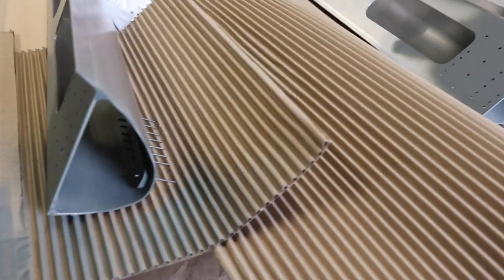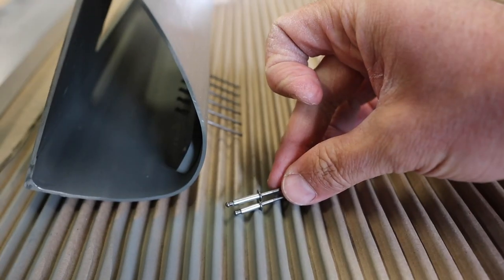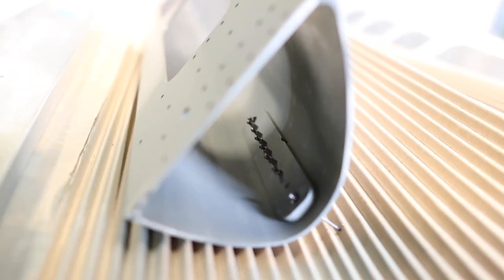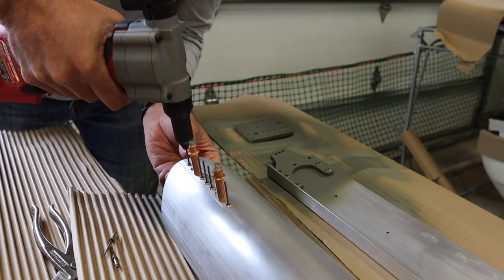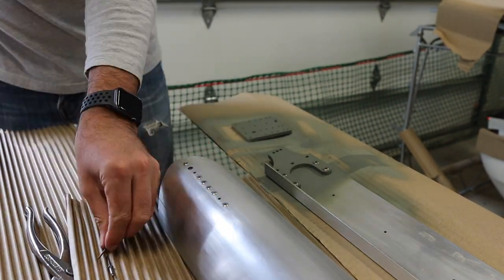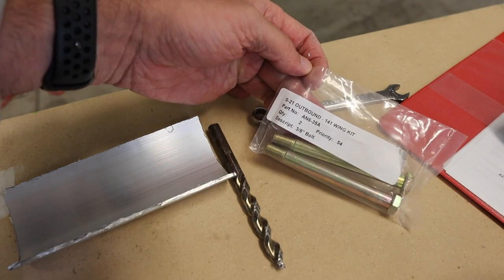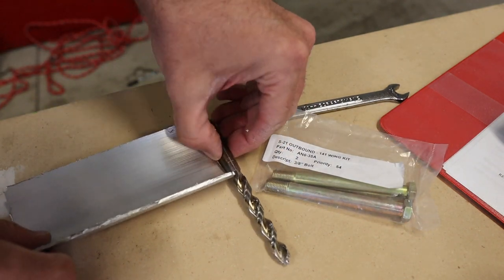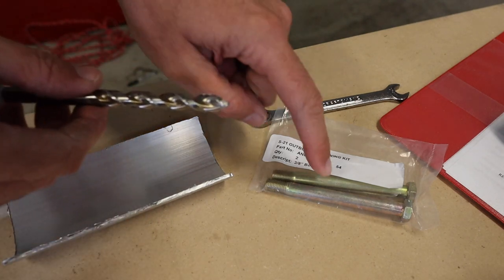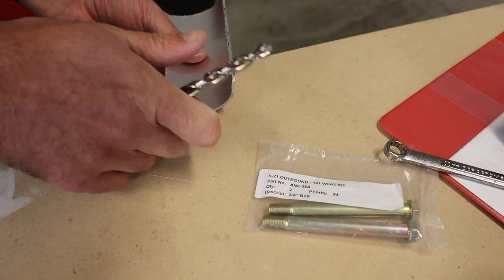This area commands a little bit more attention than the others, because the outer rivets are shorter than all the inner rivets. Also, no rivet through the second hole because I'm about to drill with three-eighths. These are the wing attach bolts — they're three-eighths inch, and you've got to do some match drilling with a three-eighths bit. They say to test the bit on a scrap piece of metal to make sure the bolts fit snugly.